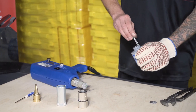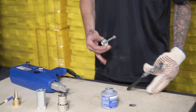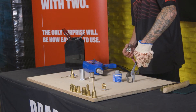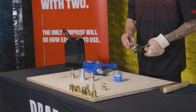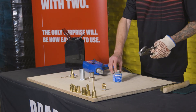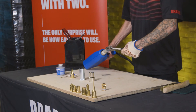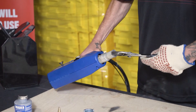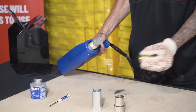It's very important that this heat transfer paste gets applied each time we are doing a tip change. We're going to put this on the heated barrel washer on both sides. This heat transfer paste allows for lubrication as you put the components together, and we're lining up the locating pin to the barrel washer to ensure excellent heat transfer from the barrel to the welding tip.